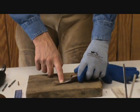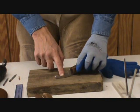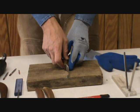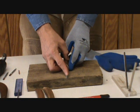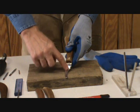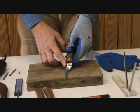as with their nippers, these knife blades are not supposed to be V-shaped. They're not supposed to be like a standard cutting knife. They are more like a chisel. They are flat on the back side and the bevel is on the front side.